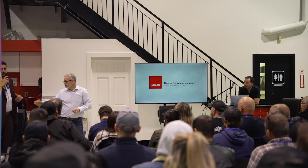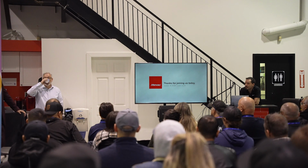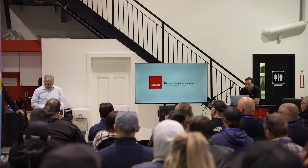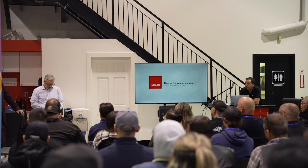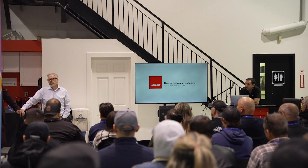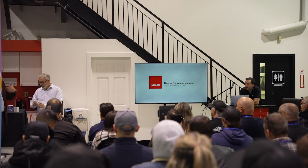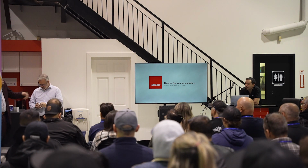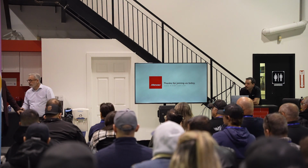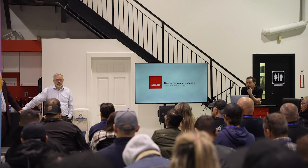That functionality that we're talking about, having ink recirculation through the damper, is probably one of the most revolutionary technologies in this piece of equipment. As you know, we've been selling the Chinese machines for over 5 years, and you really need to be dialed in. There's very little room for error. There's not that much tolerance to be successful with that equipment. People go on vacation for a week and a half, for example, and they come back and the heads are clogged and they're constantly flushing every single morning. So having that recirculation through the damper is going to allow you a little bit more forgiveness with your equipment, and not have to come in every single Monday and flush and flush, which is very common with a lot of the Chinese machines.